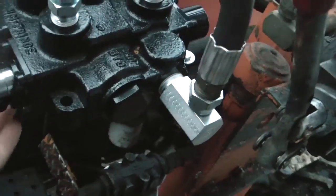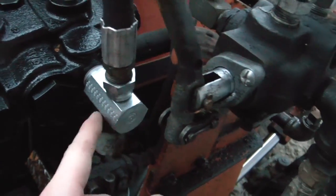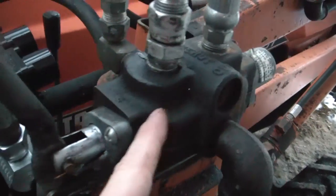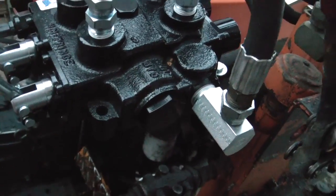The reason why this thing blew up last time — and I wasn't aware of it until someone pointed it out to me on YouTube — is the pressure relief valves feed out the output, and when you have it connected to another pressurized system, there's nowhere for the pressure to go. It just builds up until it blows apart.